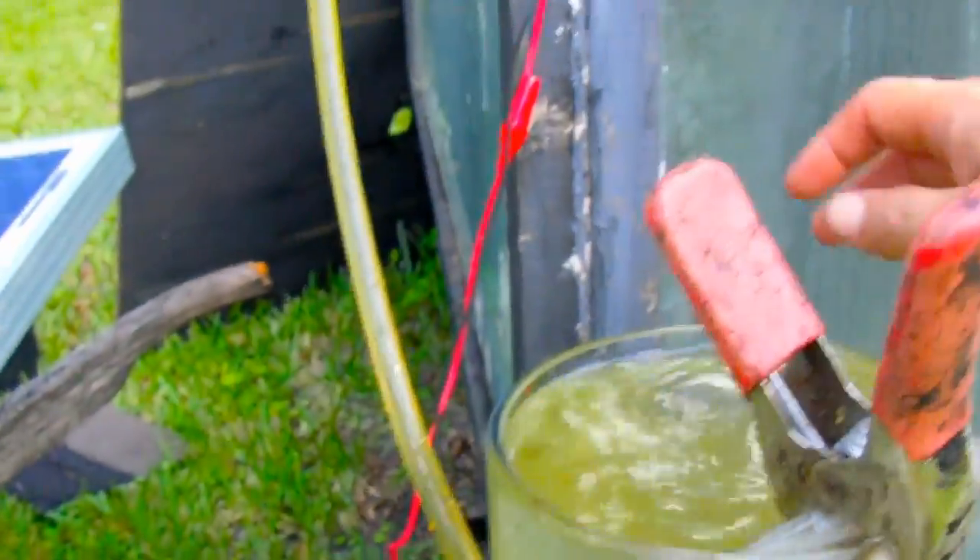Once it's primed, it's a closed system. The water lifts here, up through, over, and then flows down, and then comes out the other end. The reason that we're lifting it here is because we're only lifting a little bit of water — very light, very easy. If you try to lift it from this end with 40 or 45 PSI from a water hose, it was only able to lift water this high because it's about 40 pounds of water here. The whole system is 70 to 80 pounds. This panel is extremely heavy when full, and really light when empty.